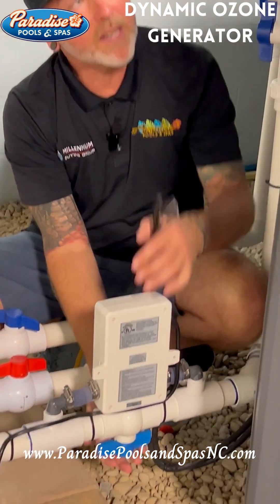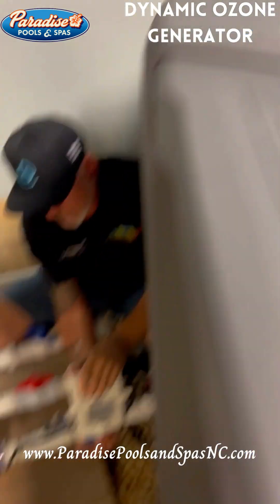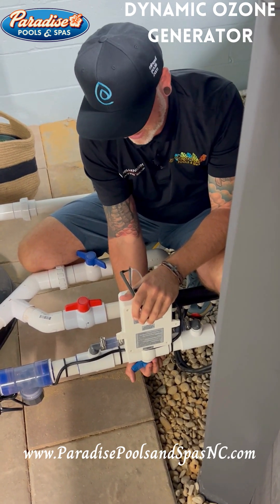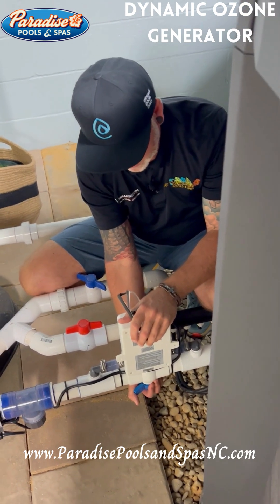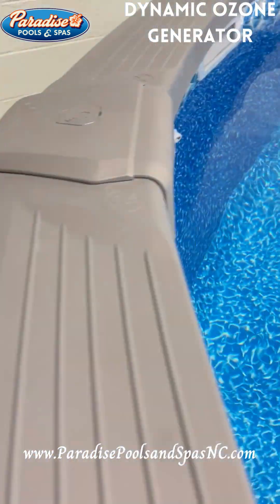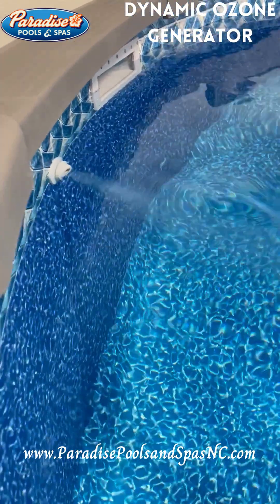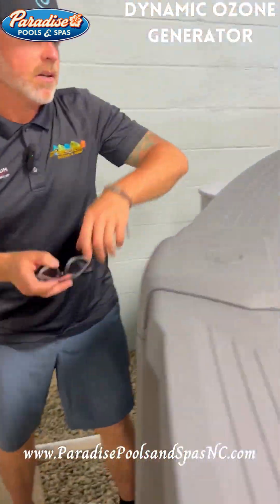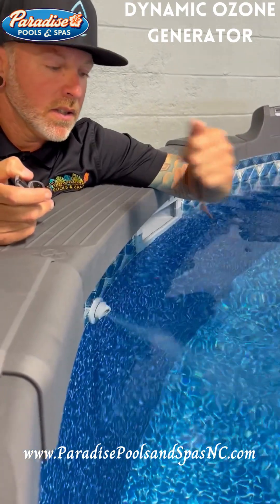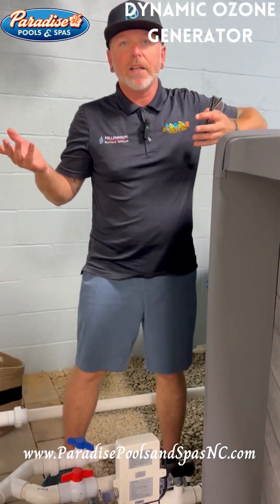You're going to have somebody watch the water flow at the return as you start to cock this lever back here. I'm going to have my cameraman tell me when he starts to see some bubbles appear. I'm slowly moving this handle down until he tells me he sees some bubbles. He gave me the thumbs up — he sees bubbles. So now you're actually implementing the O3 molecule in there, taking the place of the shock. Once you've cocked that handle, you might think 'set it and forget it' — but that's not true.